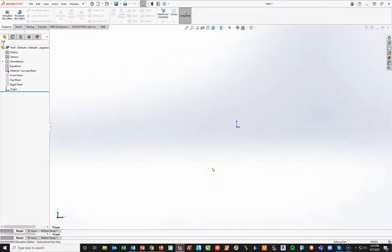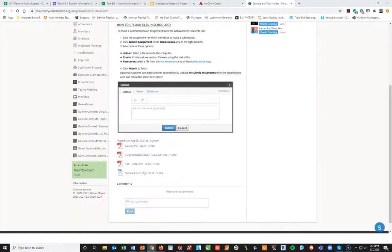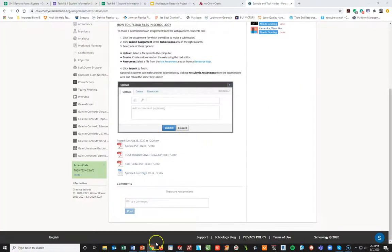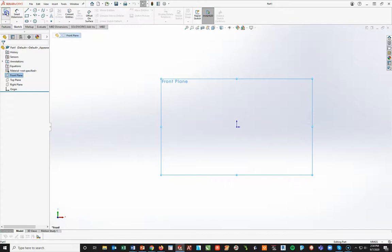Now I'm going to put my plan into action. Looking at this, I'm going to go to the front plane and basically draw this lower half as I see it — across — and then revolve that. I'm going to temporarily slide this over so I can bring the drawing to my other screen. Then I'll come into SOLIDWORKS, go to my front plane, and start a new sketch.